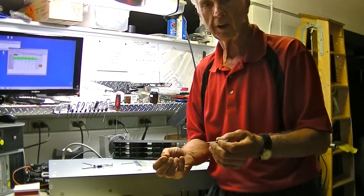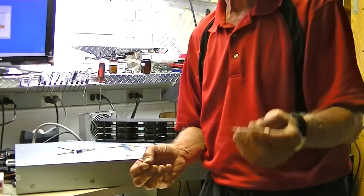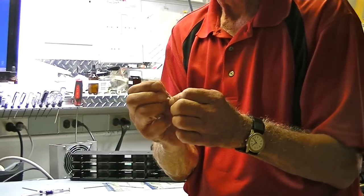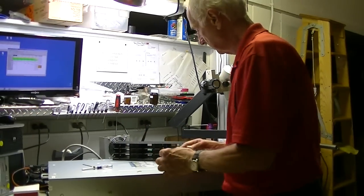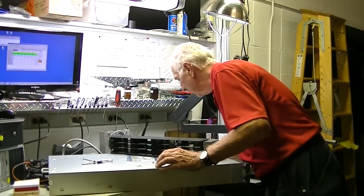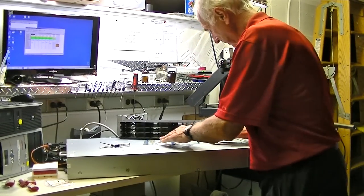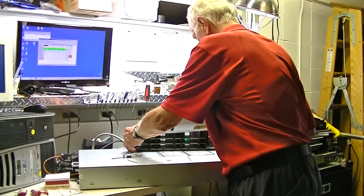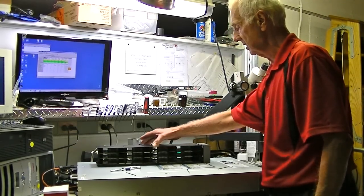If you want to go out and buy them yourself, you can. Number two nut — 56 stands for 56 threads per inch, so it's a real fine nut that goes on there. On this one, we had seven of them that were out, and we also had one that was actually bent. The top part of it was bent, so you can see a lot of damage and how unstable this particular magazine is.